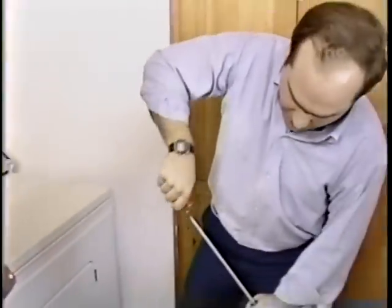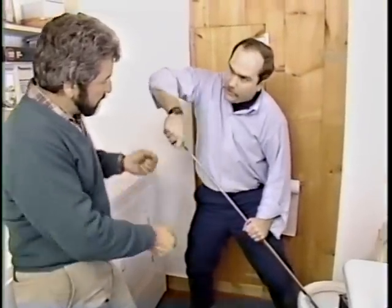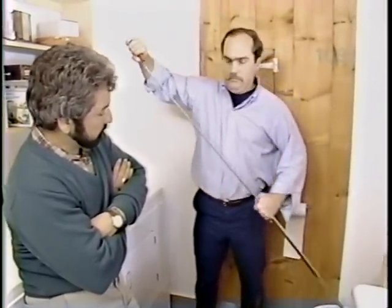And in a clockwise motion, you try and hook the stoppage down inside. So that's forcing the cable deeper down into the waste pipe. Right. If I felt the stoppage right here, I'd continue the clockwise motion, but I'd draw it back. Start pulling it back up. Right. What if that fails? Well, the only other alternative is to pull the toilet up.